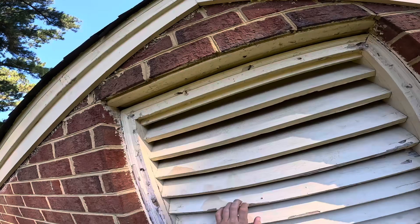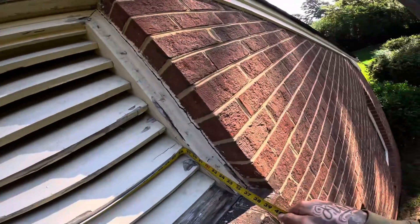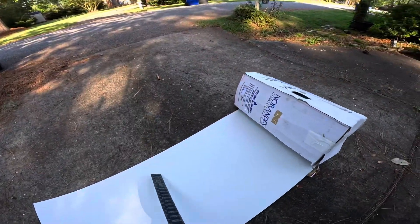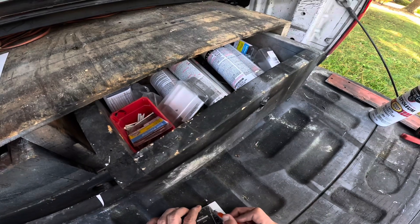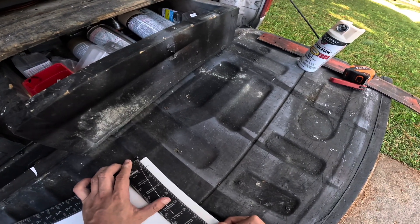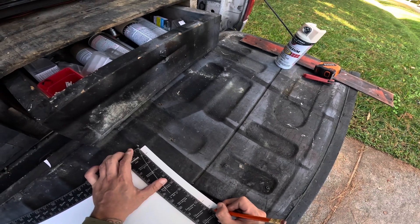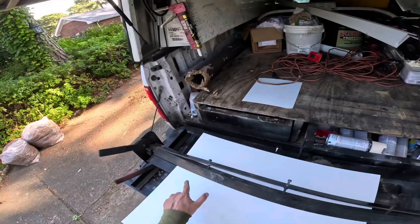These louvers are just one-by-eights and they are 28 and a half inches long. On the three-quarter side we'll do an extra three-eighths so it can grab underneath, but we don't need that on the back side since that can just hook on. Take our framing square, run the blade down the edge — I'm going to start with that three-quarter to hook on the back side, then go seven and a quarter for the width of the louver itself, then down another three-quarters for the bottom piece, and then three-eighths to hook onto the bottom. We'll transfer this to the brake, put that last line of the measurement on the brake, and then score it.